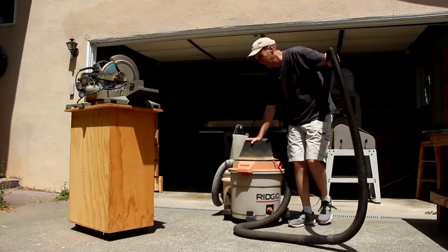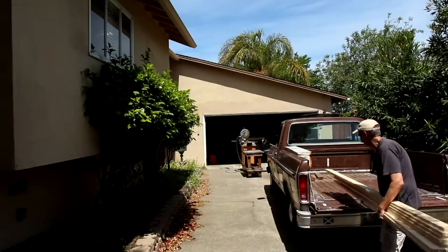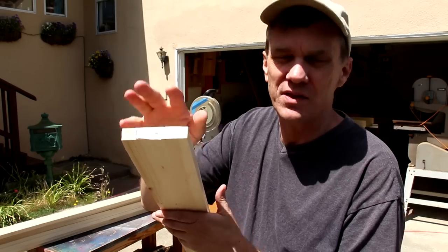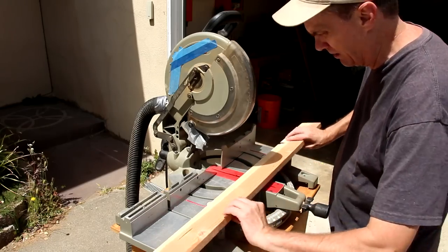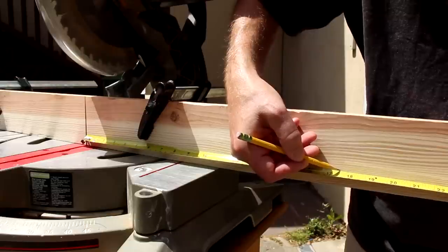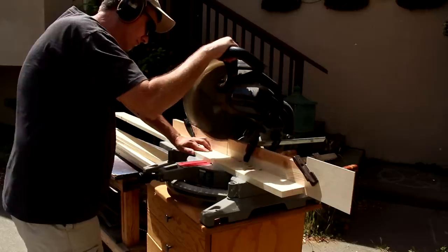I'm back working on our craft room makeover this week with these awesome storage crates that you can do anything with. I picked up eight of these pine boards — I think they're furring strips. They're three and a half inches, about nine centimeters wide. They've got knots and some of them are kind of rough, but I think that's okay for a crate. To make it even simpler, I'm going to cut all of the pieces to the exact same length. The fence on my miter saw isn't long enough to hook stop blocks on where I need them, so I'm just going to clamp this board to it. I can measure from that slot the length that I want my boards to be, then clamp this board on to use as a stop block. As long as this stop block is in place, I'll be able to get every board the exact same length.